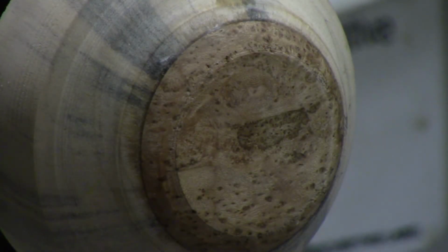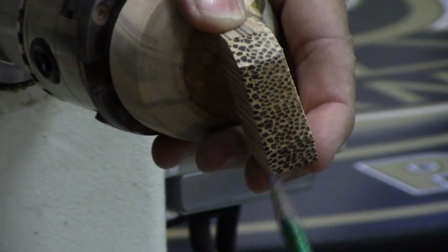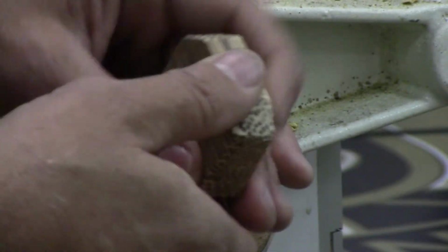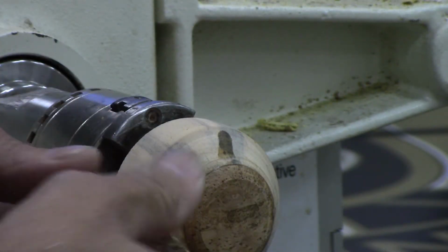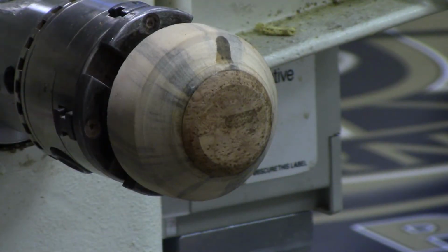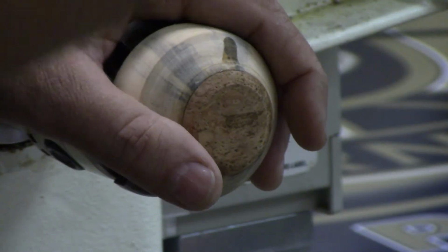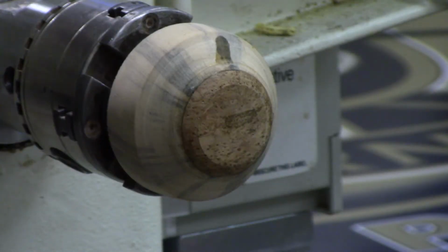Now, the scraps I have left over, like this palm, you can see on the camera, this is thinner than this section. This is not a true square parallel piece. I have taken one side and flattened one side on the belt sander. So I have one true flat side. Joe, he flattens one side on the belt sander, then flips it over, flattens the other side. You think they'll be parallel? No. Almost always you're putting pressure and one side's going to be angled. That way he stacks them up and your piece is spinning and you can see the lines wavering. After he cuts the top, that top is true. And when they're sitting there, you don't really notice it. But on the lathe, when it's speeding up or almost stopped, you can really see it going. So that's something else you need to consider.